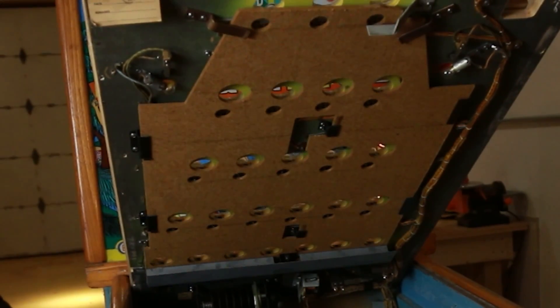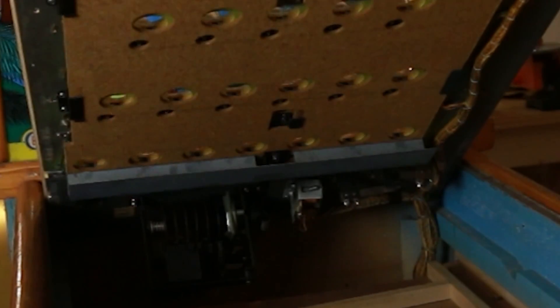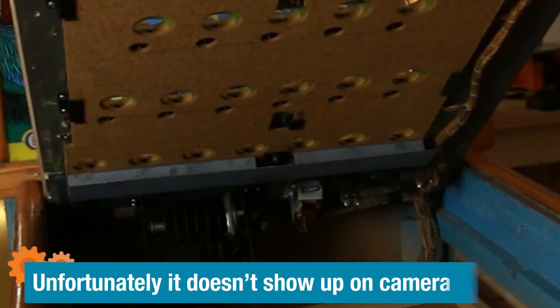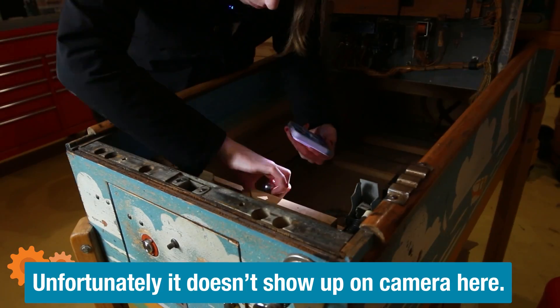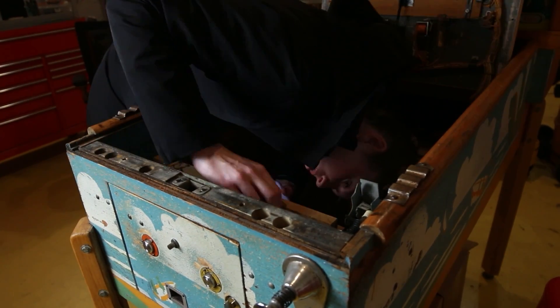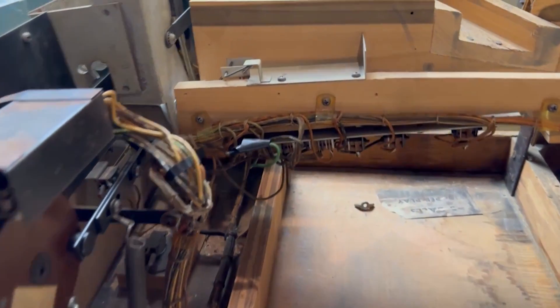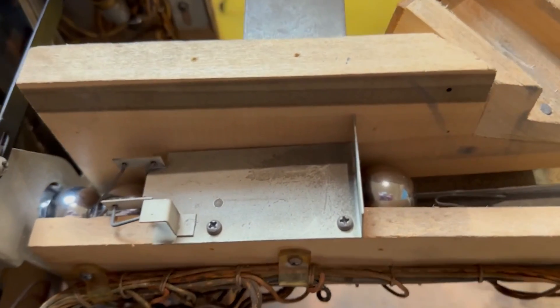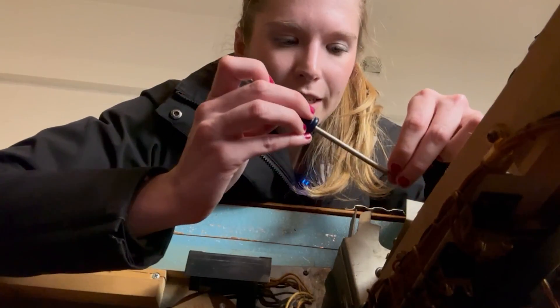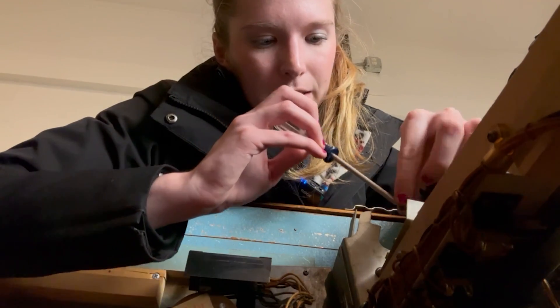That sounds promising. The ball still loads — that's good. This is the face of me realizing I had in fact broken something on Miss Creaky, or at least found something that wasn't functioning as well as I thought the first time around. So I started off by trying to reset the play field and noticed that a lot of the balls weren't falling through as they were supposed to. You can actually see things arcing. After some research, I discovered that the most likely cause behind the shutter mechanism and the ball lift mechanism not working is a series of contacts that live under the trough.